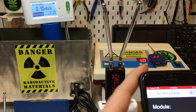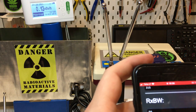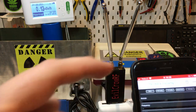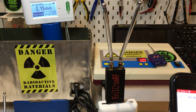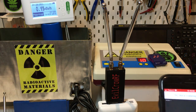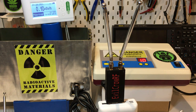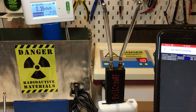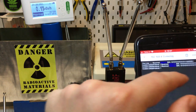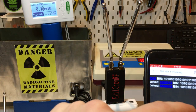Okay, we are in. I can start recording again. Now I'm connected to Evil Crow RF. Now we set the configuration — we know the frequency from before. We can decide between which RF module we want to listen. I will say RF module 1, frequency 315 MHz, gain 50, apply. It should have worked, and now we go into RxLog. Now it is rebooting. Okay, as you can see, no logs. Now it's listening on the first antenna, trying to listen and decode packets on ASK. Let's try shooting again. There, I'm getting my lovely dose of radiation, and here if I refresh — voilà, we got the binary sequence! As you can see, it's almost the same — actually it's the same as the one sniffed with the Flipper.